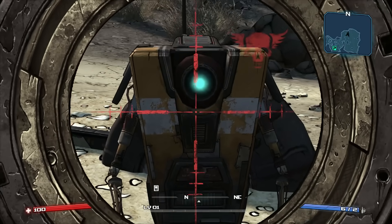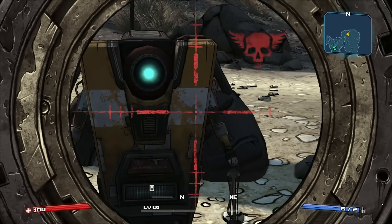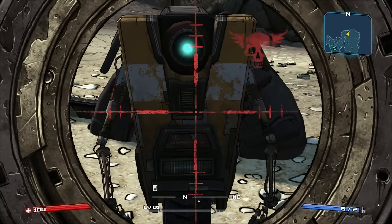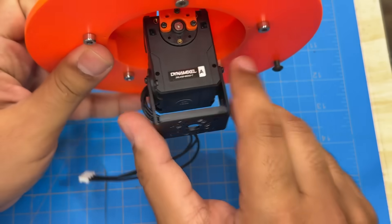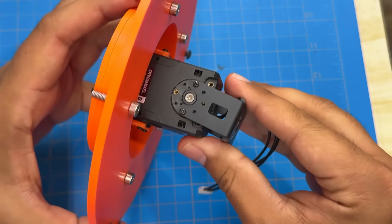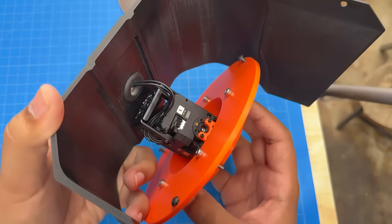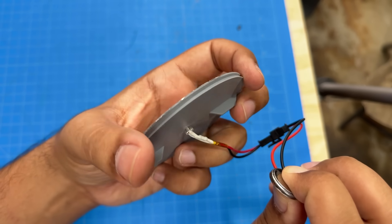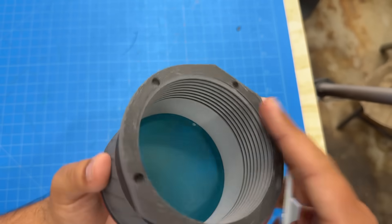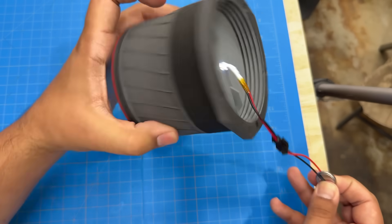Claptrap's eye is basically a camera lens shape with a glowing blue light within the lens. It modulates slightly when he's talking and can move around, but that's about it. In order to make it move, I've mounted it to this dual-axis Dynamixel that allows it to pan and tilt. This mounts to a larger rear shroud piece that hides the internal mechanisms. The light comes from this white LED that is mounted to a thin plate with threads. There are matching large threads inside the eye so that I can dial in the distance to get the exact spot size I want.